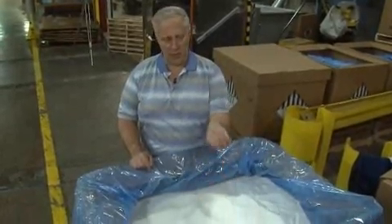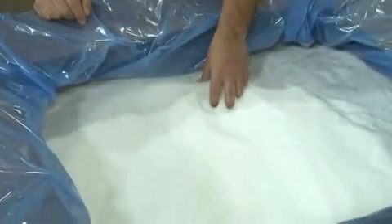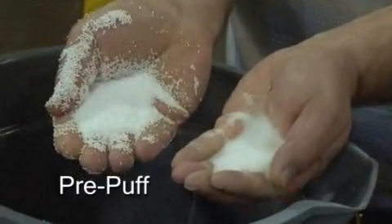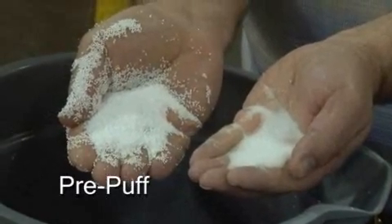I'm here at the beginning of our steam chest molding process. It's a little noisy here, but I'll try to speak loudly so you can hear me. The steam chest molding process starts with polystyrene beads like these. They are impregnated with a material called pentane — a gas that will puff the bead up when it's heated and make it into a foam. That process is called pre-expansion.